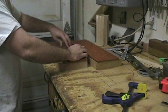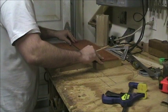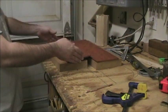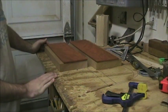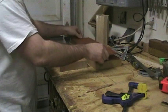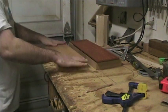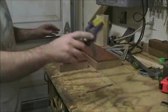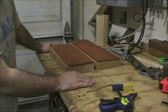I'm going to put this piece on about where it needs to be in preparation for gluing and draw a line across, then put this piece where it needs to be — right up to the center — and draw a line across. That's just going to give me about how far I need to get my glue out, because one piece is a little bit longer and I don't want to waste glue. So I'll turn this over and cover the entire side with glue, then cover the other side, flip it and start lining my clamps all the way around it for really even clamping pressure.